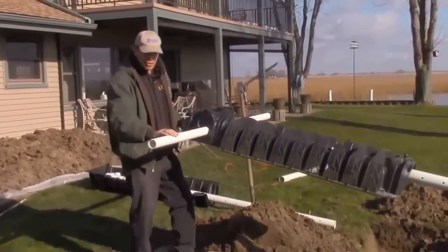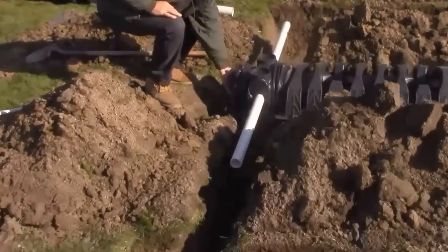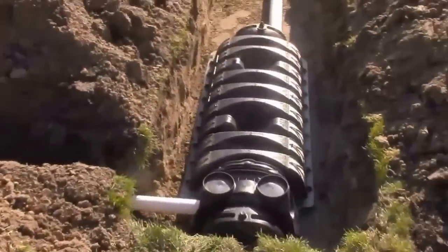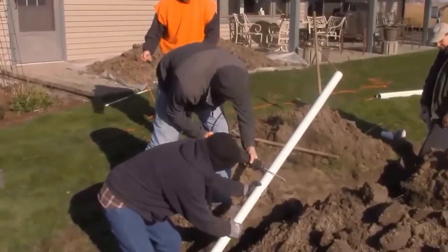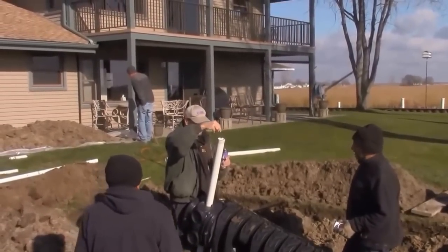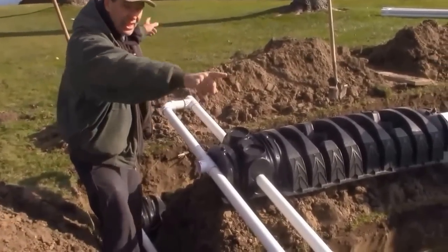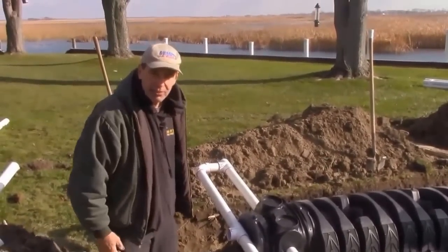I made these legs a bit long so I can trim up the fit for the T — it's going to supply up to go in the middle. We assembled the crossover. The input water is going to come in and feed the center of the three legs. Here's our center input. We're going to plumb this in the hole and then glue our two outside rails in, and away we go.